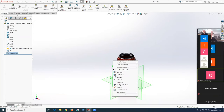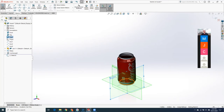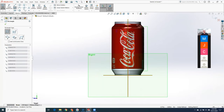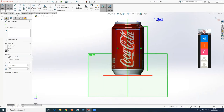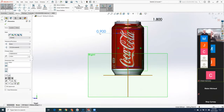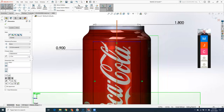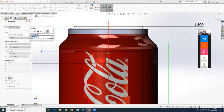Okay, next thing I want to do is put in the opening so I can get my fingers in there and attach all the connecting rods in the Stirling engine. So I'll create a sketch. Do a rectangle. And let's see, 1.8, so that's the width. We'll go 0.9 so that it's centered. Distance up 3/4. Sure, we'll just run with that.